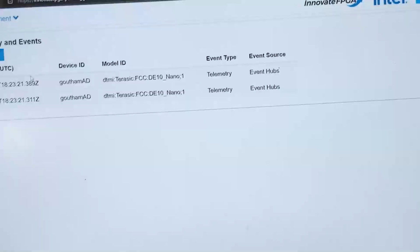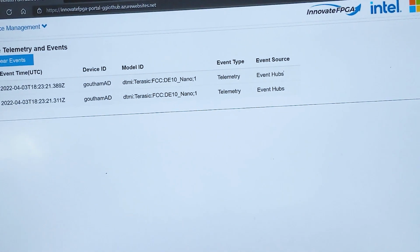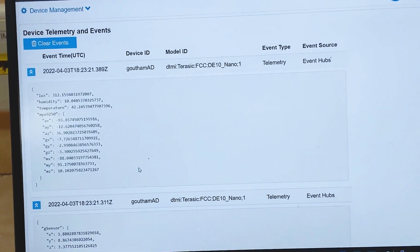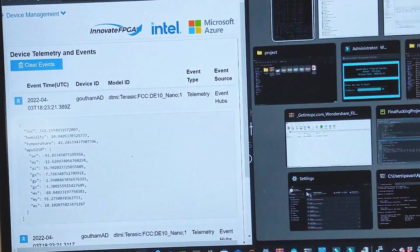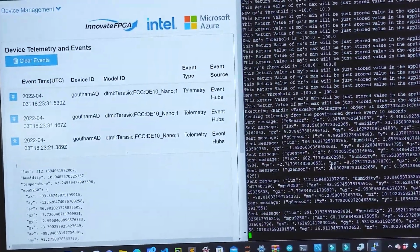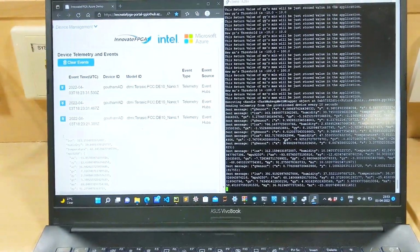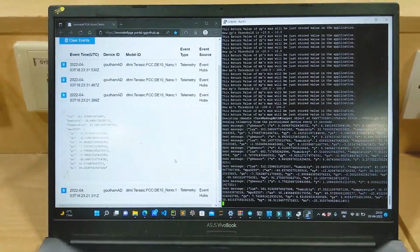We created an Azure IoT service to interface the RFS module through the cloud. We created a device provisioning service for IoT Hub. We got the code template from the Azure GitHub page and modified the code to push the ambient temperature and humidity value to the database along with Azure IoT Edge.